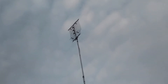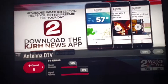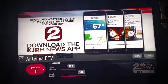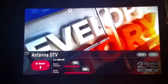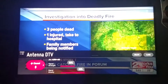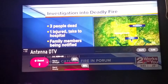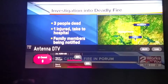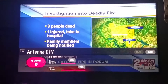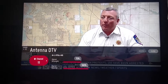It's 20 feet off the ground, pointed toward Tulsa. Let's see how well it works. There's channel 2 again — the signal strength hasn't really gone up, but the signal quality is now almost 100%, whereas before it was about 50%. Signal quality is SNR, so there's less noise on the new antenna. That may be because I was running a booster on the old antenna, which boosted a weak signal but hurt the overall signal quality. Channel 8 is now at 100% signal quality.